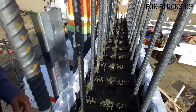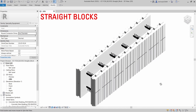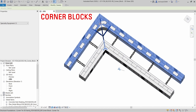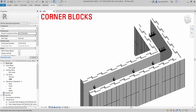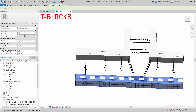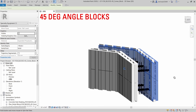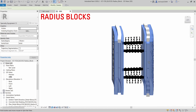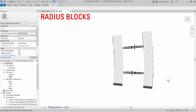Fox Blocks has a variety of products. Straight blocks make up 80% of ICF wall assemblies on most residential and commercial jobs. Corner blocks have corner brackets designed to add more strength and support to eliminate blowouts during the concrete pour. T-blocks are used where two walls intersect, like an exterior wall to an interior wall. 45-degree angle blocks provide more design options and also have a corner bracket to reinforce the vulnerable edge. Radius blocks are 16-inch long specialty blocks used to build curved walls and must be specially ordered.